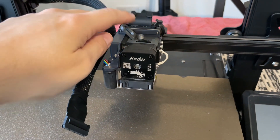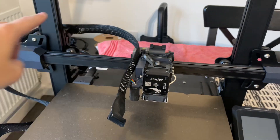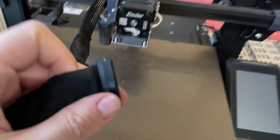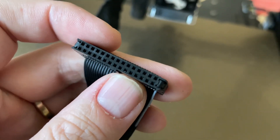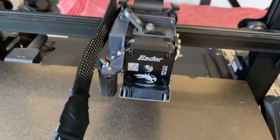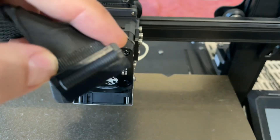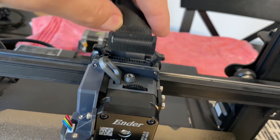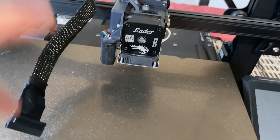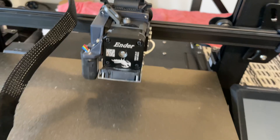I'll start with the main lead that goes into the motherboard. I've already unplugged it from the motherboard. You can see there are more pins on one side because it also goes to the axis. The easy way to identify which side is which is by looking at the white wire — that's where you connect to the stepper motors. It's the first four pins on that connector, and you can find the white wires on the other side too, on the left-hand side.